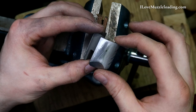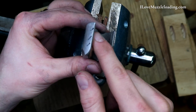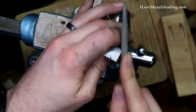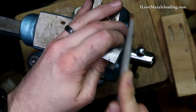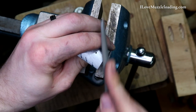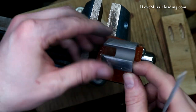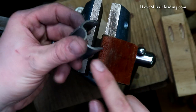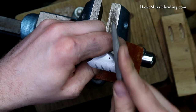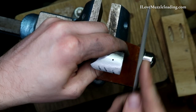Now you can see there I have a little bit to clean up back here — we'll take care of that real quick. But we have a pretty nice curve all the way around. Got rid of those lines, and we have a nice even finish. So to clean up where I've kind of nicked back here, I'm going to cut a slight bevel on that end. When I'm doing something like this, it's good practice to stick a piece of leather underneath, so when I'm coming over to clean up this other side, I'm not dinging or scratching my cleaned-up face over here.